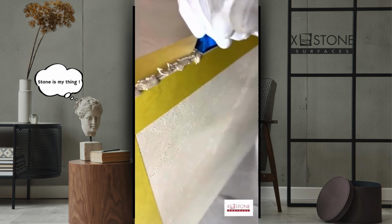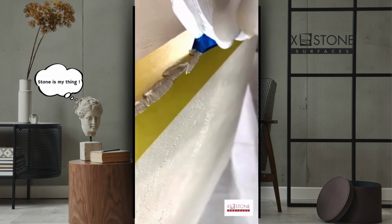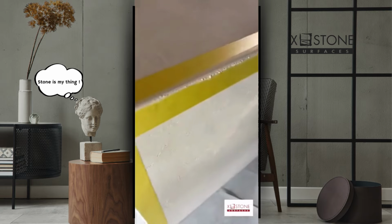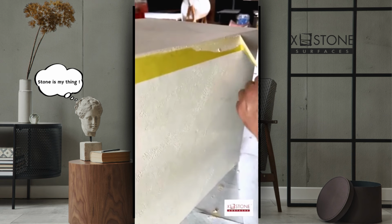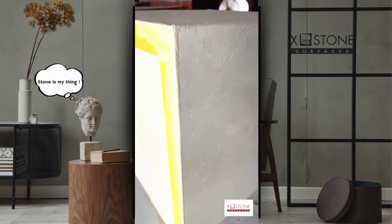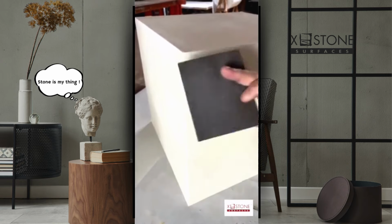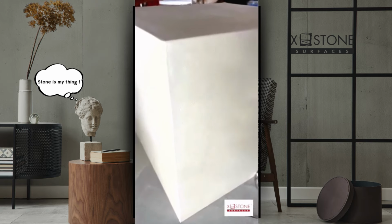The paste has the same color as the pieces, and you can apply it properly and close the joints. When you finish this, remove the material you don't need. Peel off the tape while the joint filler is wet. After 20 minutes, the corners are dry. And when you like, you can scratch this softly, gently, a little bit. Okay, so I think it looks perfect now.